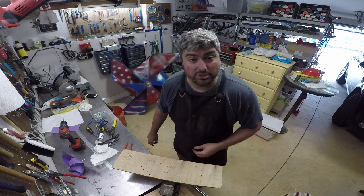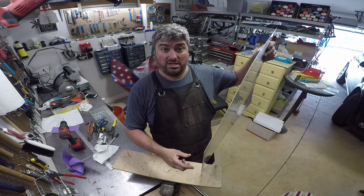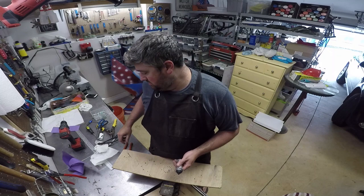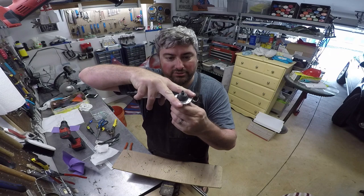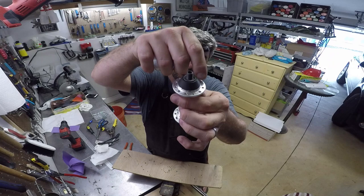We start with a two-foot square sheet metal — well, whatever size. This one happens to be two-foot; we just need a square. We're not going to make one of the big ones today; we're going to do one that's about half that size. Mark the center — I drew a diagonal all the way across, then diagonal across the other way. Mark the center, and then we need to drill out a hole. We want that hole in the sheet metal to fit right over the hub. I found a hole saw that fit just right so it's not going to cut into the spoke holes, because we want metal over those spoke holes. I cut a hole like this.